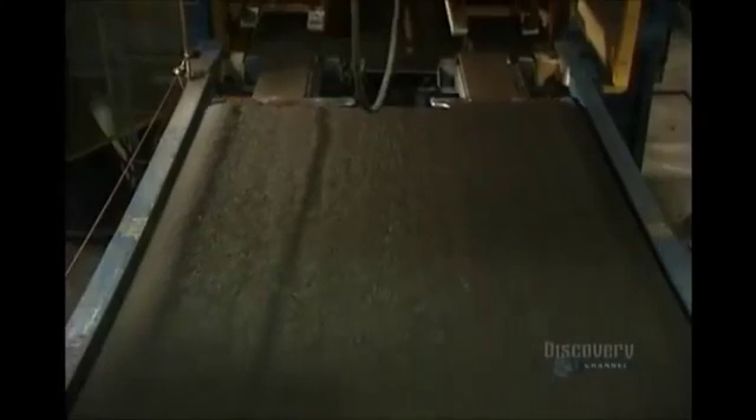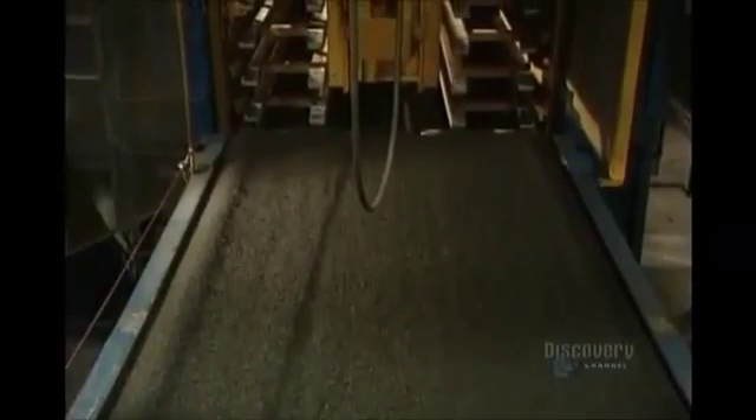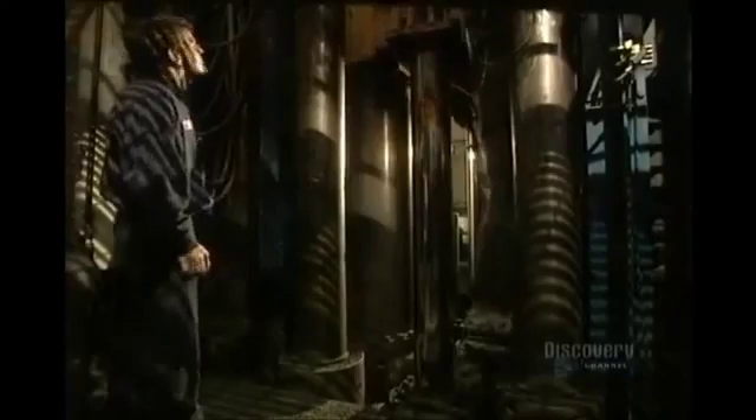The powder is spread out on these enormous molds. This mold has a length of 7 meters and a width of 1.2 meters; thickness varies according to the product being made. The molds filled with rubber powder are stored in the loading magazine of the press, and once full, the molds are sent to the rubber mat press.